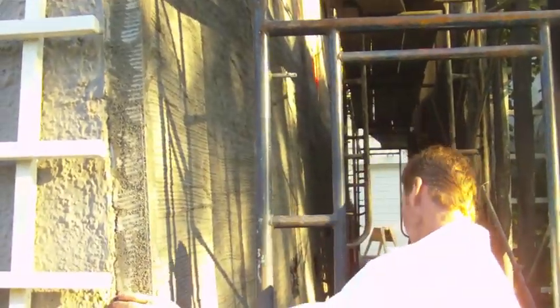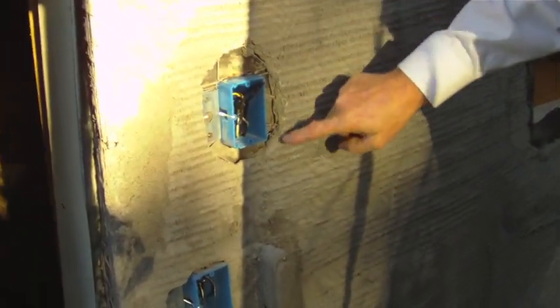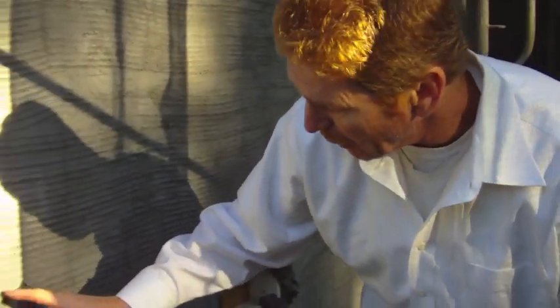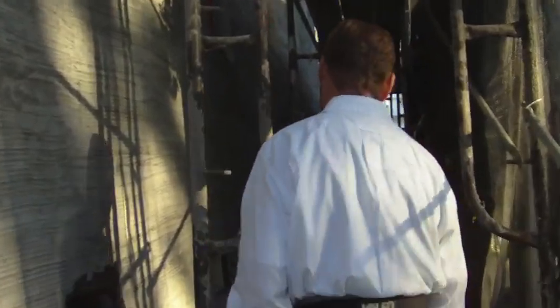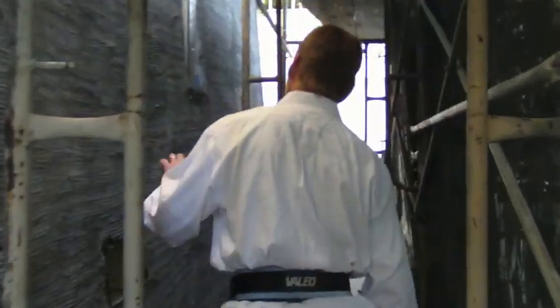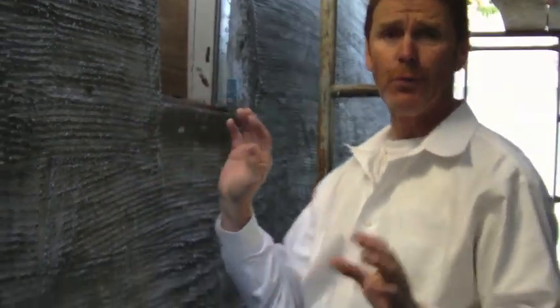Nothing we can't handle. Over here we've got electrical boxes and this pipe — we broke out their scratch coat here. Notice that they did not use a polyurethane caulking around here, so we're going to go ahead and break this one out around the pipe. They didn't do it here, they didn't do it here. We've got a few issues with their vents. If you look up right here — I'm not certain what the camera will show — on the next level it's barely scratched. The mechanical bond isn't very good on the entire addition.